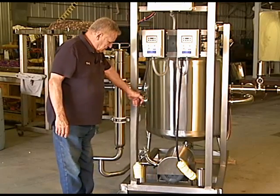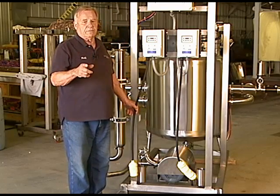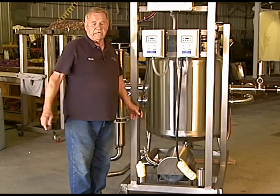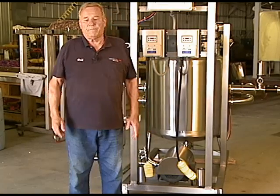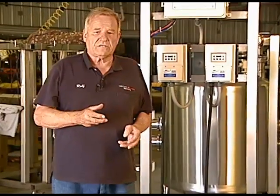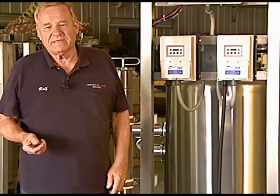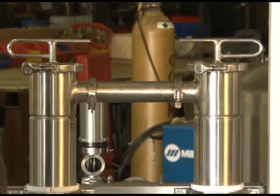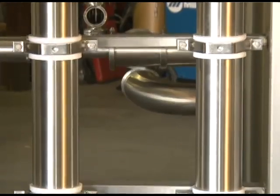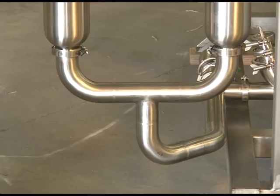There is also a second standby pump, so this particular customer ends up with two 10-horsepower pumps. The pump is not bolted down, so if something goes wrong you undo a few clamps — you'll want a second person because that pump weighs about 200 pounds. Lift the pump out, put the second pump in place, redo the clamps, and you are back in business. Our regular group has one milk filter, four inch by 33 inches; this one has two, because of the number of cows.